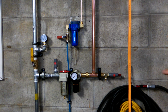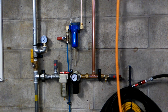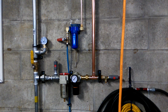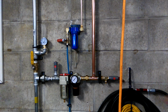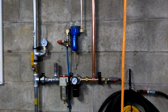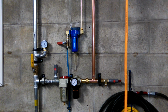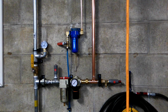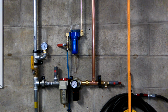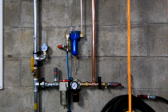One main issue with the normal coupler here is that if you are, let's say in this case, connecting a long hose and you want to disconnect it, quite a bit of air and energy is stored in that hose. So what will happen is the end that's open will actually have quite a bit of force once you disconnect it, which can be pretty dangerous. And since this is my garage setup and other family members will be using it, I prefer to be safe than sorry. Now, that's what led me to purchasing these connectors from work.